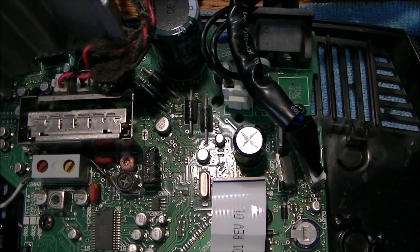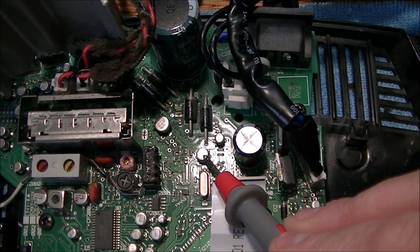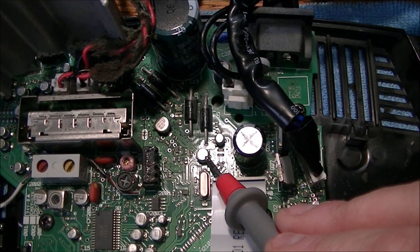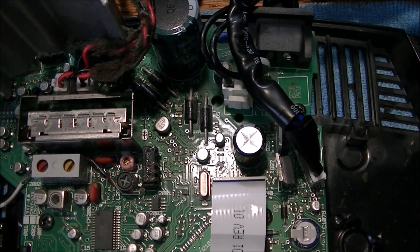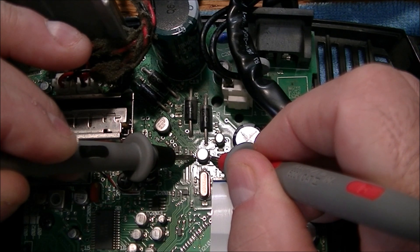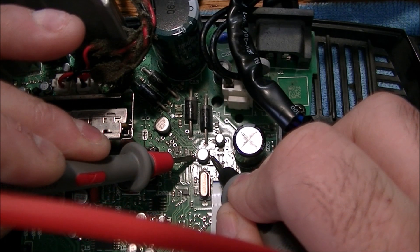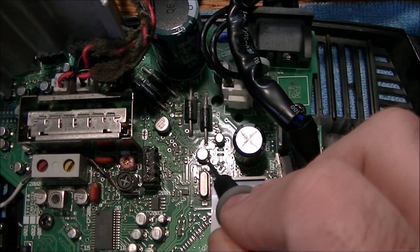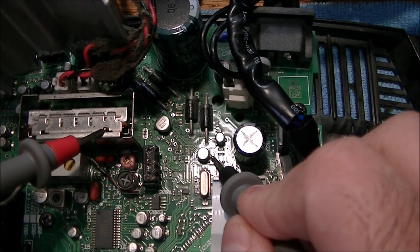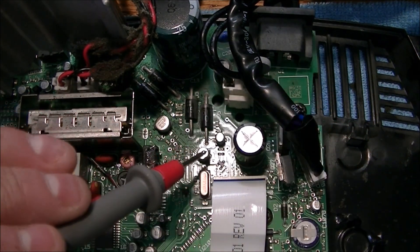Back again, still no further ahead. There is a capacitor here - 2.2uF 50V - but it's not marked negative or positive and I'm not getting a consistent reading either way. Testing in real time: one way it reads 2.45, the other way it reads 6.2 to 6.1. I put it to continuity and there's no ground on either side, so I'm thinking that's not actually a capacitor, although it does look like one.